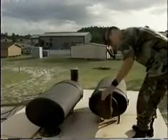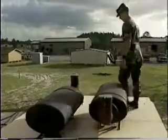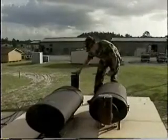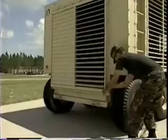While you're up there, the exhaust system should also be checked for leakage and security. Don't overlook that rain cap. It must operate freely. After carefully climbing back to the ground, open all the unit and radiator louvers. The access doors should remain closed unless access is required.